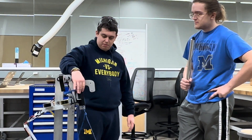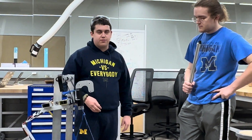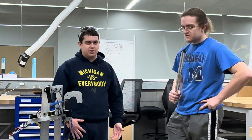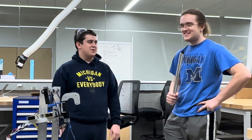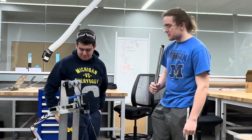And then it's just got this paracord. Make sure you're using paracord that's rated for the weight of your robot. We don't actually know what the rating on this one is, but it's over 120 pounds — it does lift John, who is definitely heavier than any FRC-legal robot. Moving on. That's pretty much all there is with our climb.